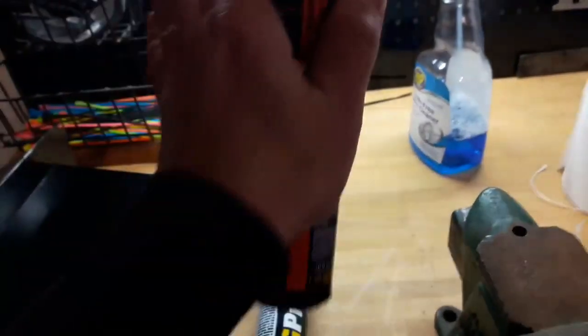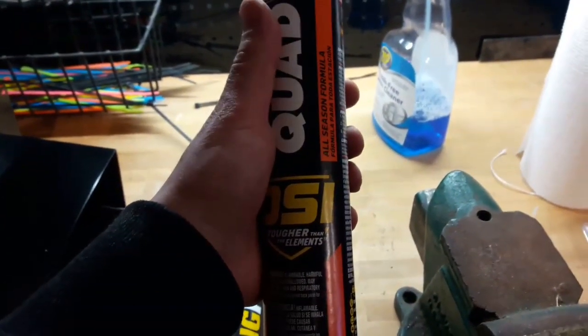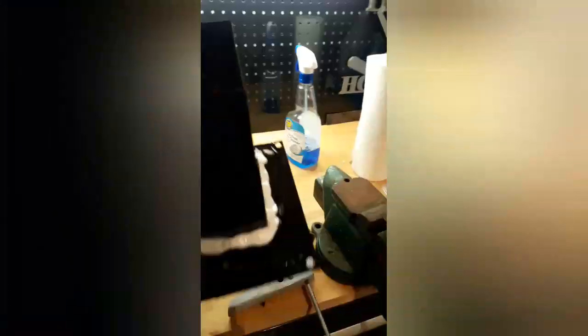And then once I put those two beads around, then I'm going to put it into the siding like I had shown you before. And then I'll screw it in and put the siding back on. This is what we got it looking like. Nice and caulked all the way around. That should create a good seal. And then this will screw it in also. I'll show you what it looks like when it's screwed in. And I actually got it all screwed in at all the corners.